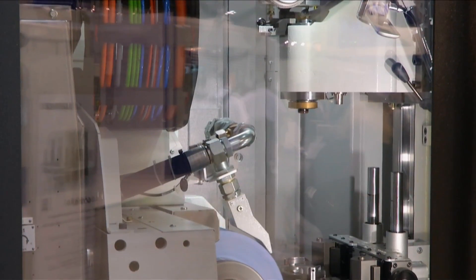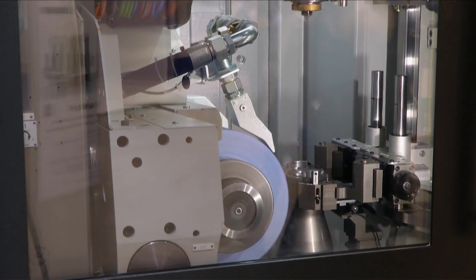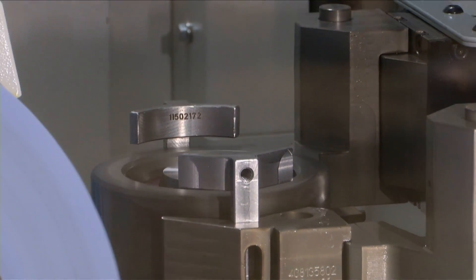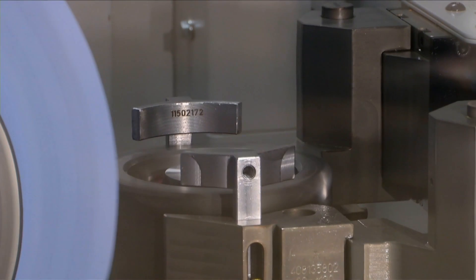The motivation behind the construction of our LG G280 was to build a compact gear grinder with a high cutting performance. High cutting performance means that we are able to use generation grinding tools up to 100 meters per second. A further point is to reduce the idle time. On the LG G280 we achieve a chip-to-chip time on bore parts of 4 seconds, and for lay shafts we use 6.5 seconds.